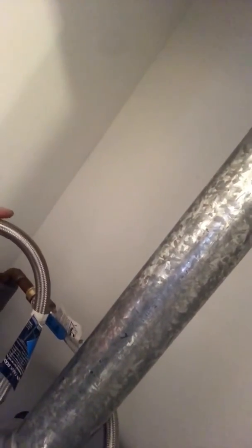Also up here we've got no pressure tank. We always recommend a pressure tank when it's in an area that has a finished space. So the potential for it to leak, even though we have our drain pan down there, we just want to have a shock absorber for the house, right? Just to help the longevity of this guy, to keep it running optimally, and then obviously have pressure throughout the house as well. But it's just kind of a little bit of insurance for the water tank.